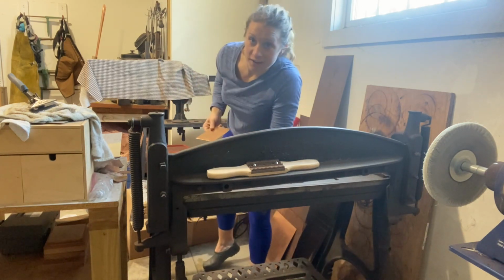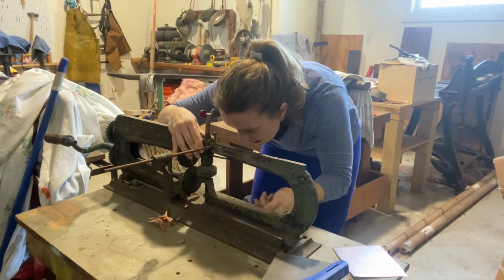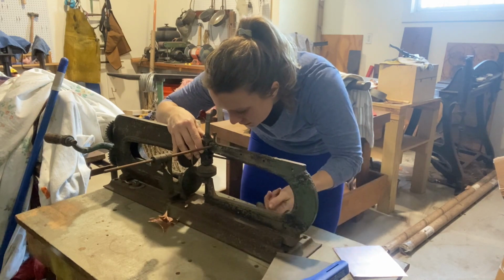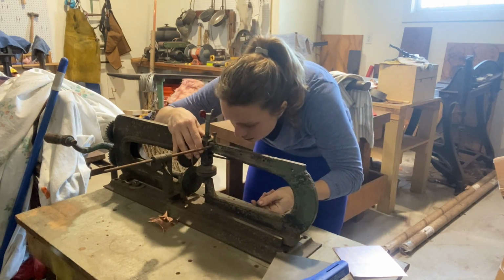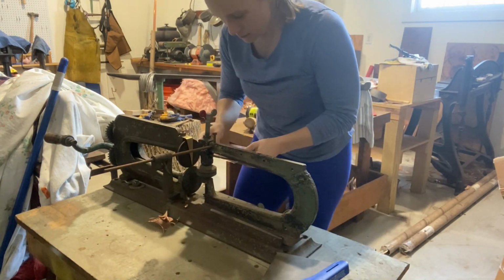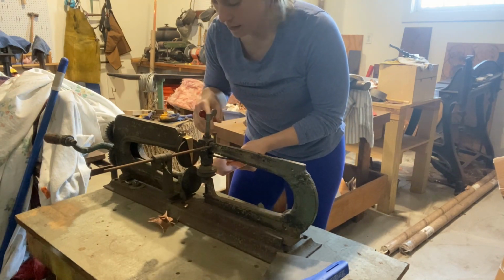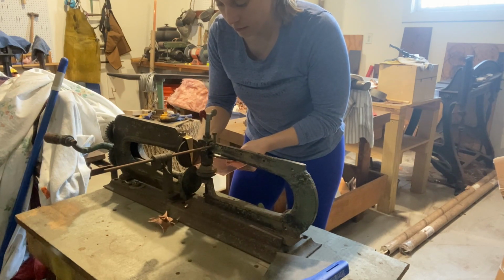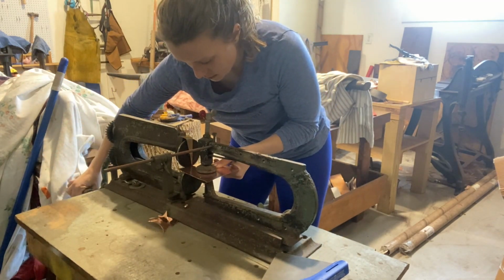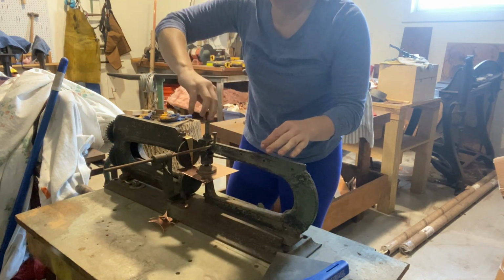So over to the circle cutter. Okay, so here at the circle cutter, I'm going to adjust this to be 4 1/4. Really close. And if you watch my circle cutting video on how to use a circle cutter, I'll explain this even more in detail, but you want very little material going under the cutting wheel. You want to stop right in the even area.